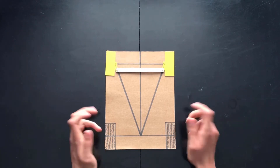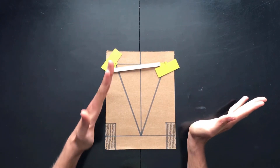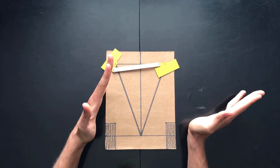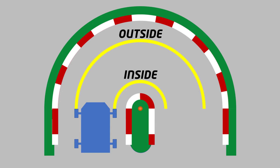And this is what they came up with. They realised that as you go around a corner — let's say right — the inside wheel needs to turn more than the outside wheel. If it didn't, one of the wheels would be sliding instead of rotating, and that's not good for grip or stability. So why does one wheel need to turn more than the other? If we think about the paths the wheels need to take to go around a corner, the inside wheel travels on a tighter radius than the outside wheel. You can see this for yourself — if you hold out your hands in front of you when going around a corner, whichever way you go, the outside arm will always travel a further distance.